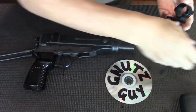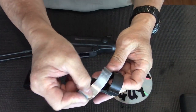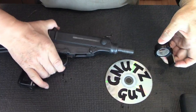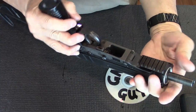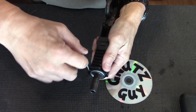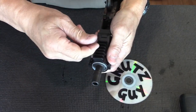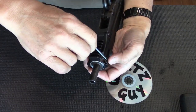Okay, here I'll put these shims in. I cut three of them like that. Fits right in there. And then slide them over. Make sure it's centered, and then tighten these four screws. Make sure you rough out those shims, otherwise this barrel clamp rail tends to rotate.